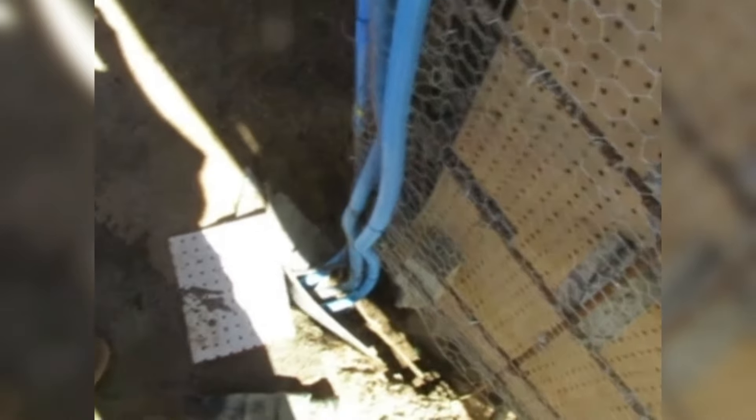Dave, we need to have more flex down in here. Need that board much closer that way. That piece of rebar is no bueno. Want it to go straight across so there's enough loose conduit on the end to be able to play with it for the electricians. So if you can just push that — yeah, there you go. Just give it like three inches off the wall — yeah, there you go. We just have a broom in the back there. I think it'll be better. And you can take dirt and dump it down the back to tighten that up.